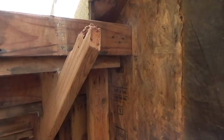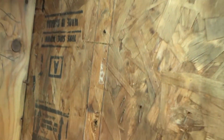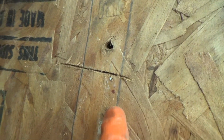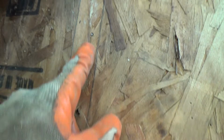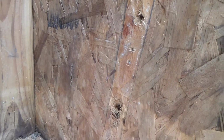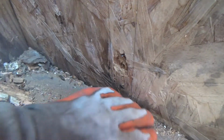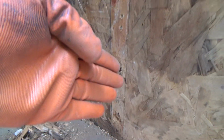And then I've got to cut. I've got to take this out, and I'm going to take it out next to the pencil line, or just beyond it. But just beyond it, there's staples, see? I don't want to hit the blade on that. With my skill saw, I can set it 3/8 of an inch or so. But lots of it I'm going to have to do with the Sawzall, because I can't get my saw all the way down here to the bottom. I'll use the Sawzall at an angle about here, then the saw up to about right here or so. And this top bit I'll have to do with the Sawzall coming down at an angle.